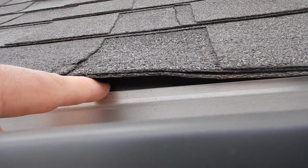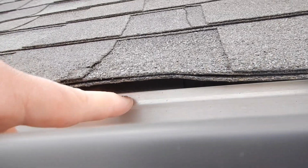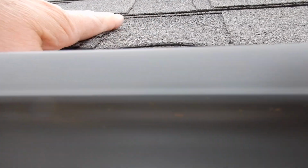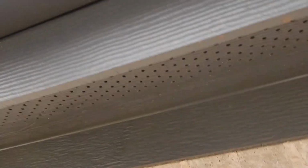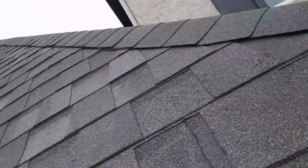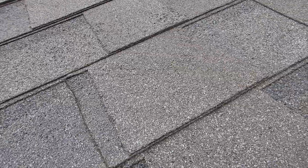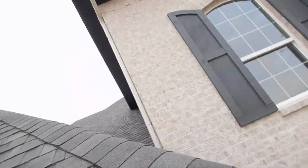This drip edge flashing right here is supposed to cascade down over the edge of this, over that bead right there. So any water that gets behind the shingles and goes down the underlayment and gets down to the drip edge, it'll curl, go between the drip edge and the fascia board. Oh, that's a cement board fascia, but it's not. No, I'm just telling you how it's supposed to go. I didn't make those rules up.